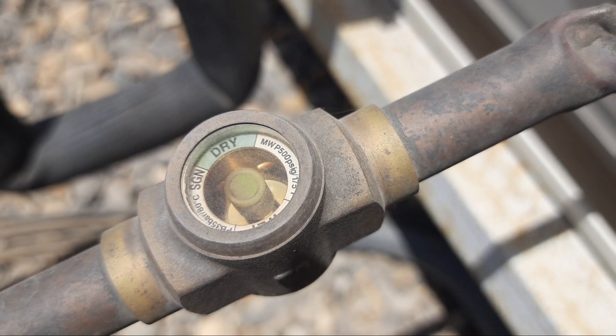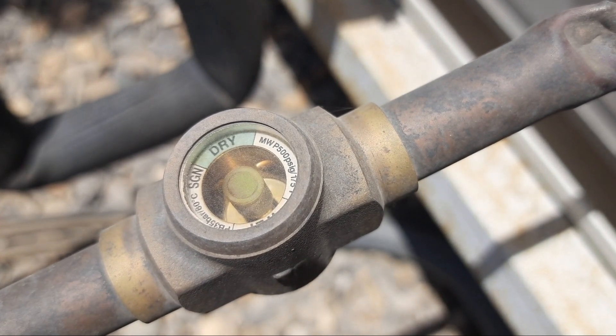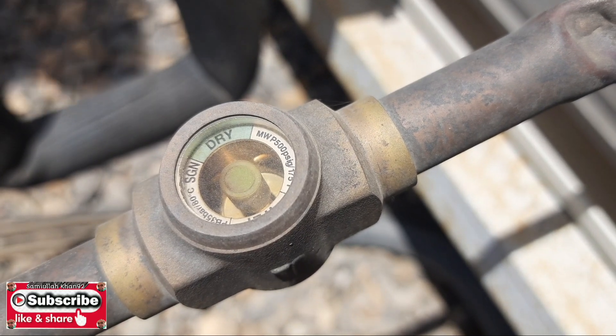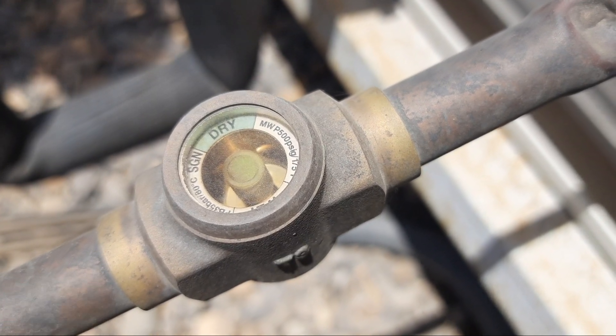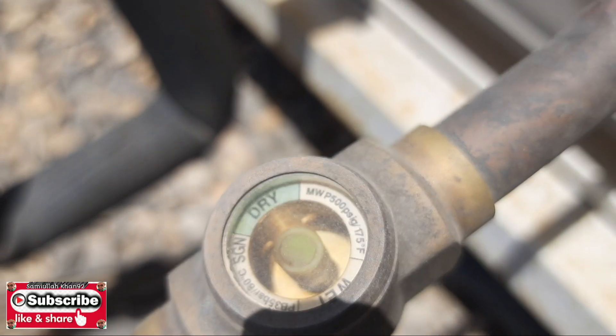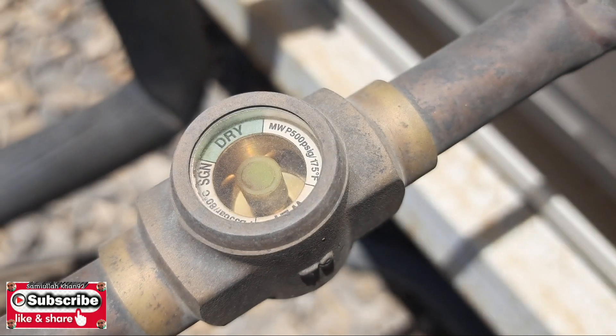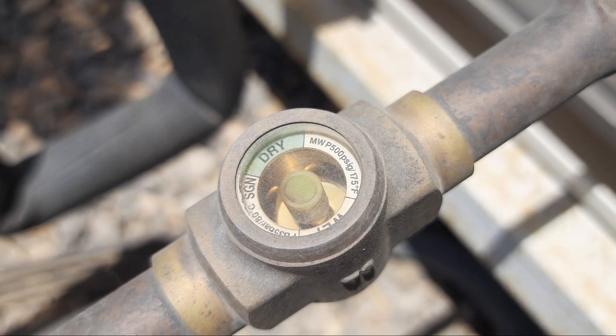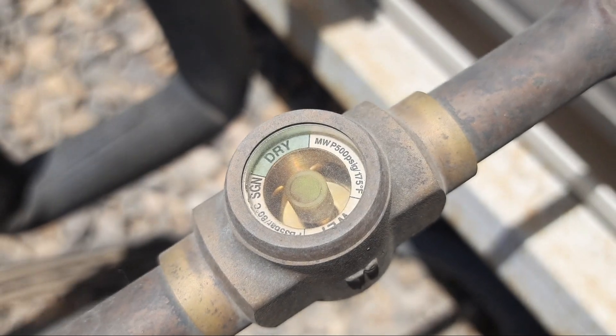The system is still running and it is now completely charged. When I checked, the suction pressure came to 35 PSI — since this is R134, that means it's fully charged. That's all for today's video. Thanks for watching Samiullah Khan 92 — please like and subscribe.